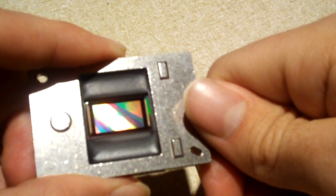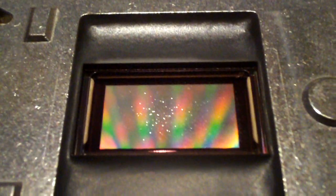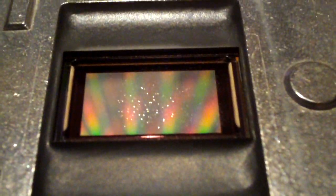When you start seeing dots on your screen, you can actually see them on the DLP chip too. Let me get this aimed just right so you can see those little dots. Here's a look at those dots — and here's a screenshot of the TV display. Notice how closely similar these dots are. Every little dot you see here is a failed mirror. The term I used — stars and fleas — represents this: fleas are the mirrors that are stuck off and show a black dot, while the stars here are all white dots.